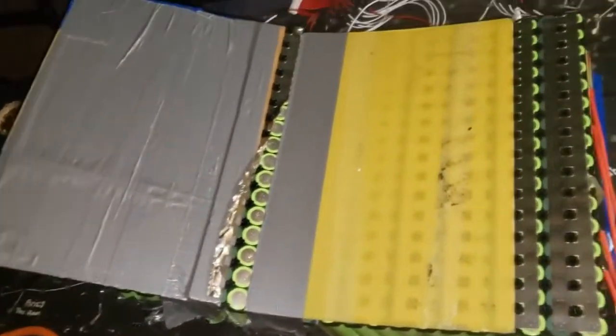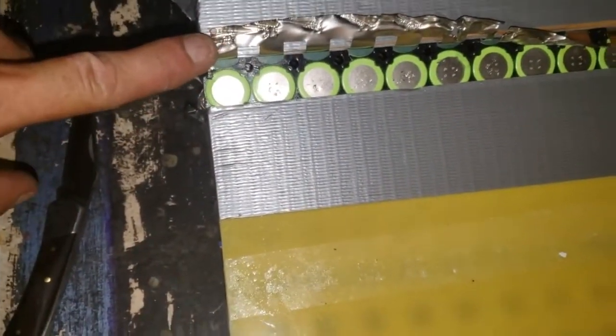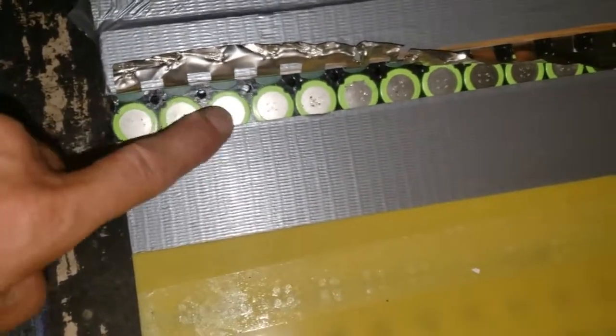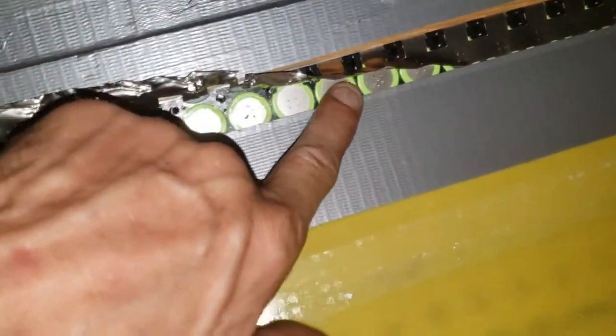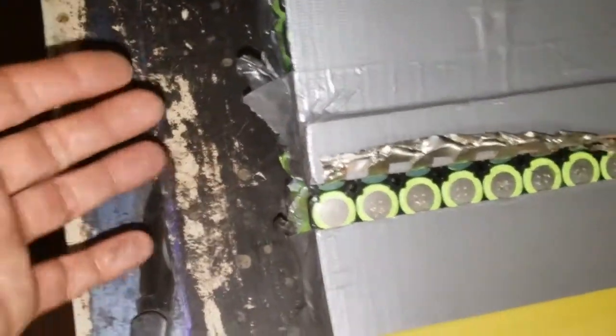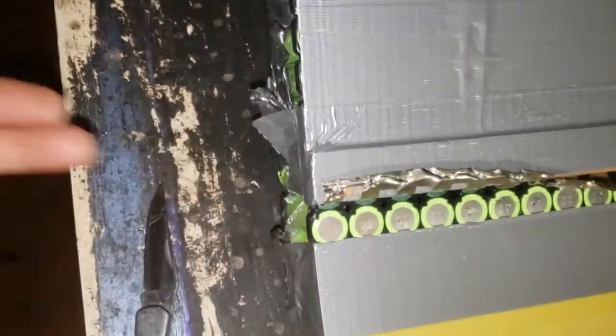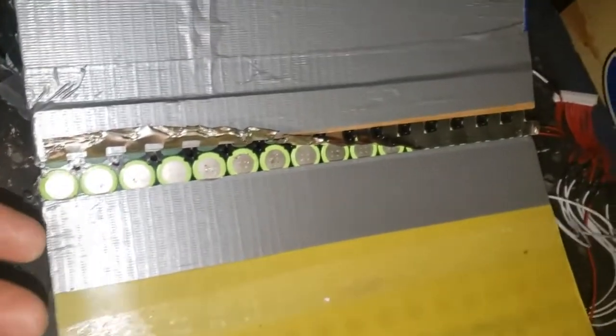Because this is the first time I've ever done this and it freaks me out a little. The next side is actually these cells up here — the positives — which are the bad ones. But I figured I'd detach it from the ground first because it's safer. Get it off the powered batteries first, and then I can pretty much pull up all these ones, slide the batteries out to the bottom, put the new ones in, put the new nickel strip on, then flip it over, reattach the other nickel strip, put the new lead on, and it should be good.